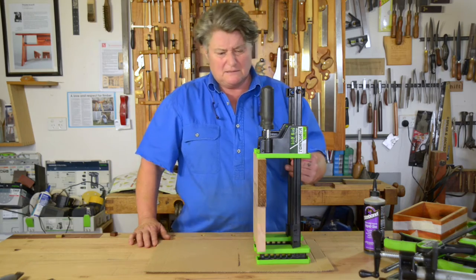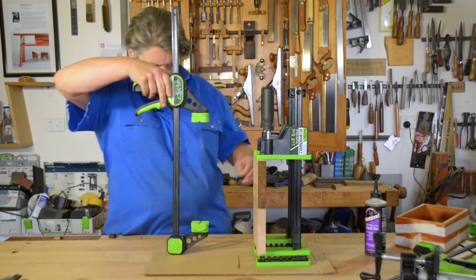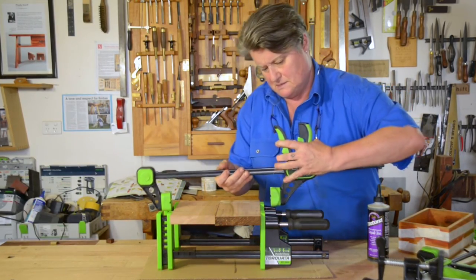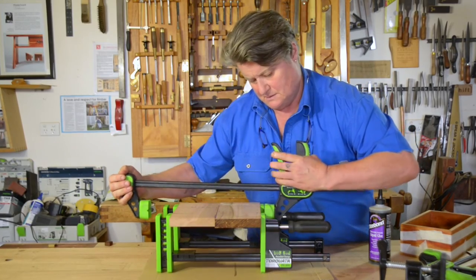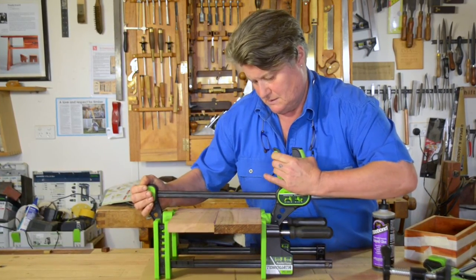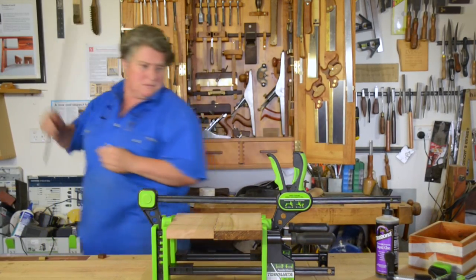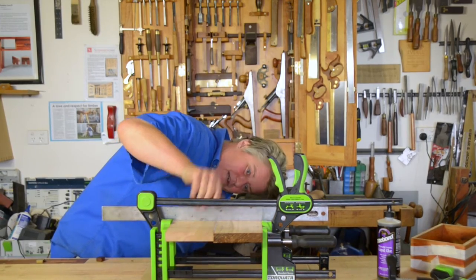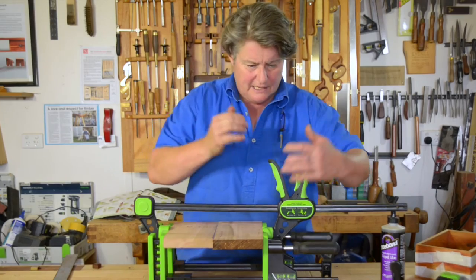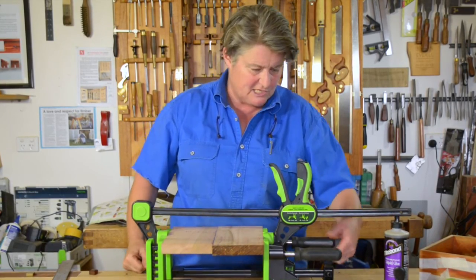I'm only doing a small piece here, as in short lengths. If I was doing a larger piece, I would always bring a third clamp in as an opposing clamp. I'm just going to lie it back down onto the ply and go with the one hand clamp this time, which is always the most useful clamp in the workshop. Then just bring that third one in, and what that's doing is now balancing or helping to balance the force. I just check across the work — that's terrific — making sure we're staying nice and flat. If it wasn't flat, I can simply increase the pressure on this one, reduce the pressure on these ones, and if I've created an angle I can flatten it out by changing the positions of the clamps.